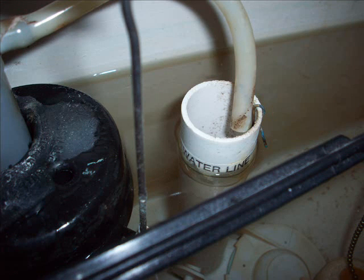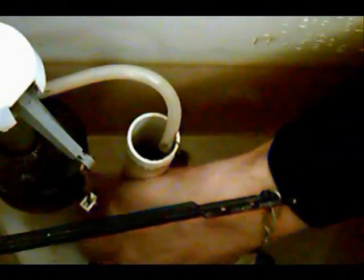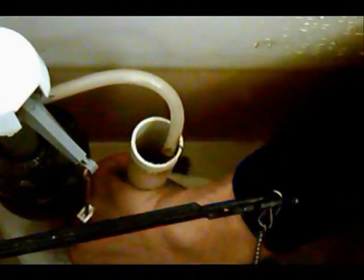Here's a short video doing that exact same thing to duplicate it. I'm going to turn the water off at the main spigot coming into the toilet, flush the toilet to get all the water out of the tank so I can work on the flapper valve — that's the valve that generally leaks. My valve snaps on, so I'm going to snap it right off very simply. Don't be too rough with it because you don't want to break those little levers that hold it on. Here you can see the rubber seal on the flapper and the seal on the main tank — those are the two seals we're dealing with.